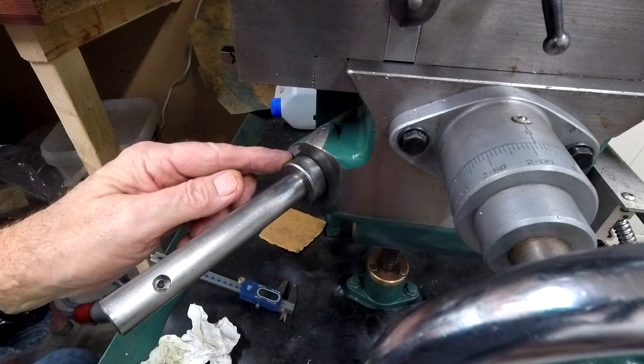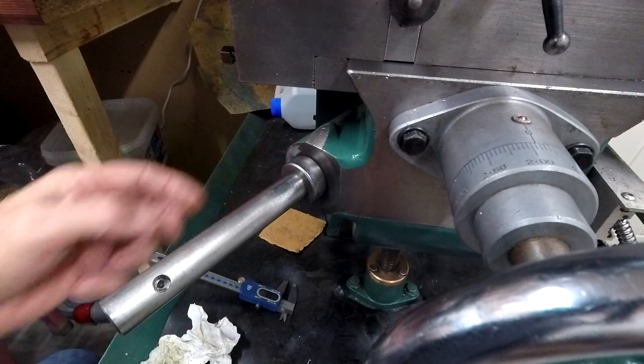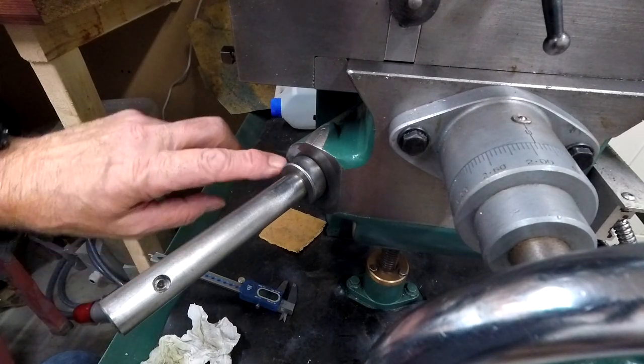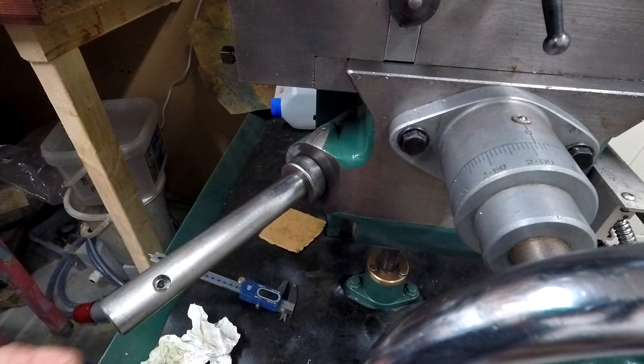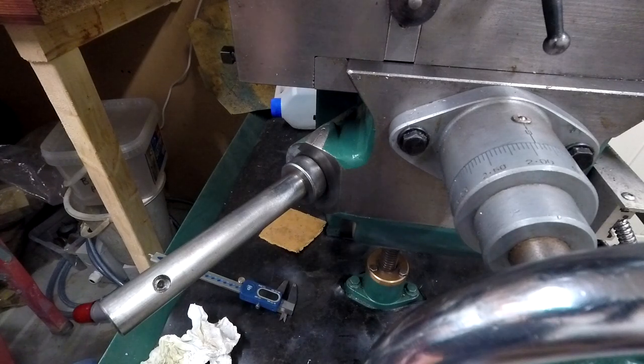Mil is that flange gap there, that edge. 6, 7, 8. Yeah, I'm pushing it a bit, aren't I, to do a 6 mil thread in there. Better with 5. It's only a 4.2 tapping drill. 3 M5s in there. I mean, I can wind this by hand. It's not the easiest going up, but I think it'll be alright. Yeah. Okay, that's about as far as I can go then.